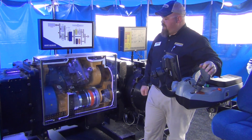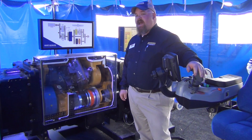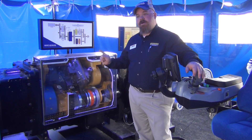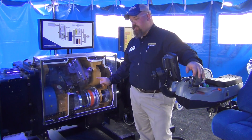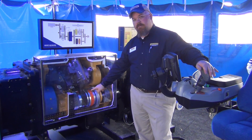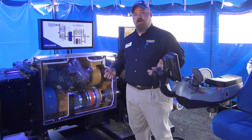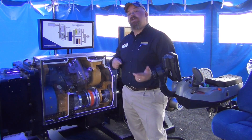What's interesting to see here is how the transmission steps down from forward to reverse. It logically steps down from clutch number four to clutch number three, clutch number two, and then back at clutch number one. The transmission protects itself all the way through the speed ranges, both forward and reverse.